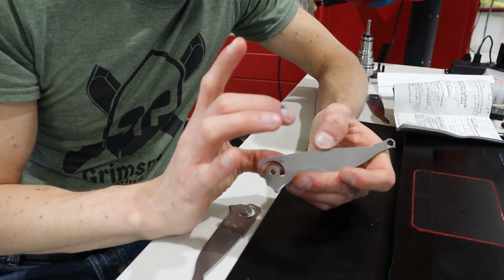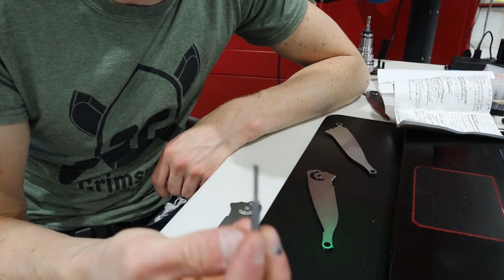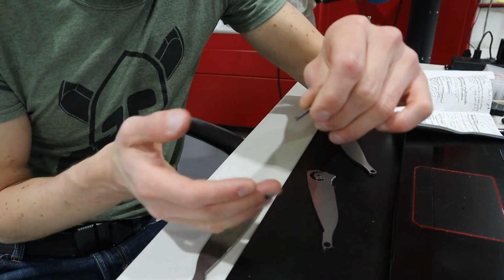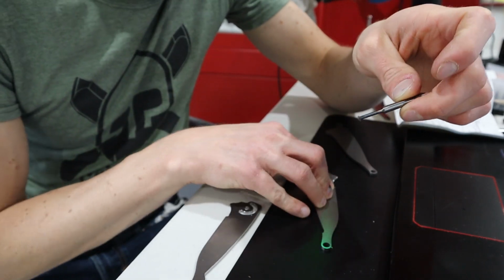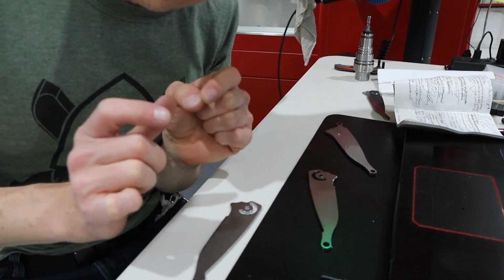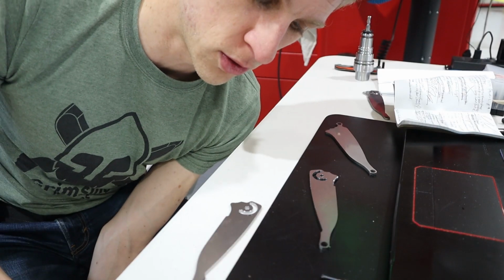And the problem with this method is it's very dependent on the thickness of the steel coming in. If that varies by 1 thou or so, which it can, that's gonna change it. And then it's also critical on the grind of the tool, the exact thickness from the tip, because I measure the tip with the laser probe, from the tip to the crest of that thread, and how thick it all is, and it's just putting a lot of assumption that the tool is perfect and the material is perfect, always and forever, for such a like 1 thou or 2 thou chamfer. And I just don't know if it's repeatable. Not the machine's problem, that's a tooling and a material problem. So I'm thinking about it, I don't know yet.